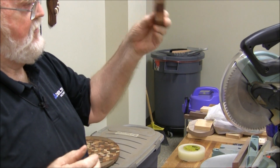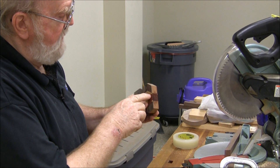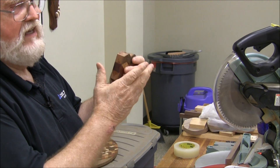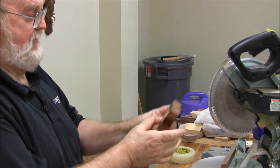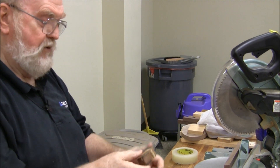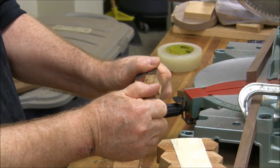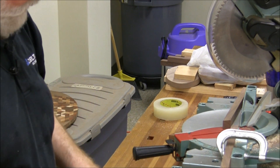You can't cut an angle on these blocks because as soon as you cut an angle on it — here's a diamond point right here — as soon as you cut that angle you're flattening it off. When you put it in a lathe and turn it, the point goes flat. And there's nothing tackier than a flat-pointed diamond. So make these up in six segments of 16, glue them up — this will be cut off here and here. Stick them up, cut the tip off, leave about a quarter inch above and below the box, cut them off, put the wedges in there, make circles.